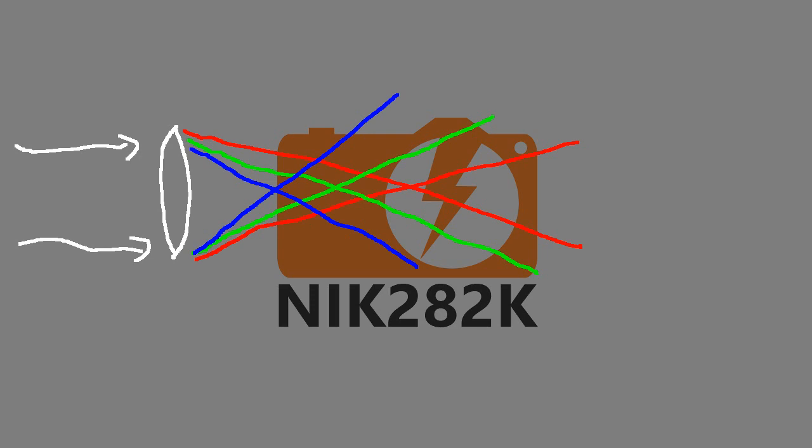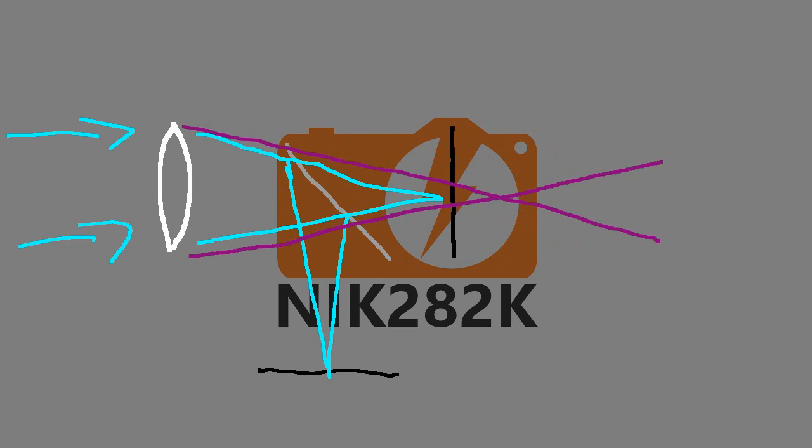All lenses suffer from something called chromatic aberration. This is due to the fact that the refractive index of glass is different depending on the wavelength of light. You will see chromatic aberration in a lens when you notice color fringing — whether it's blue or purple fringing — on small objects near the corners of the image. Chromatic aberration doesn't stop just with the visible spectrum; it also extends to the infrared spectrum. The phase detection autofocus sensor is meant to operate in the visible spectrum, probably somewhere around the green, as it's in the middle of the spectrum that we can see.